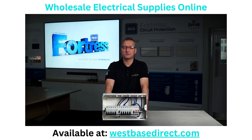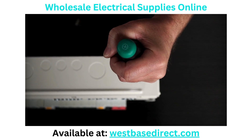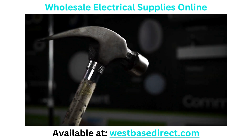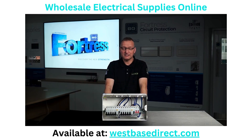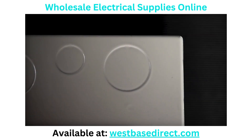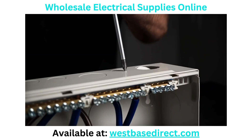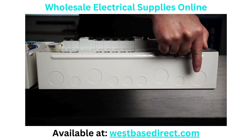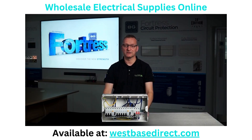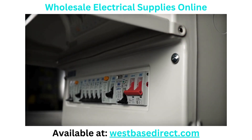Now while we're on the fortress theme, it'd be a good time to reflect on our historic knockout design. If there's one place you don't want it to be like a fortress, it's the knockouts. We've recognised the frustration tough knockouts can cause when preparing a unit for installation. Having to use excessive force to remove the knockouts is risky, potentially causing damage to the unit or harm to the installer. So to make the removal of the knockouts easier, we've removed some of the contact points, making them easy to remove when you do want them, yet secure enough to stay in place when you don't. We've also changed the position of the cable knockouts by realigning them to the right-hand side of the main incoming switch position, on both top and bottom of the consumer unit, improving the installation and termination of the incoming meter tails, and reducing strain on cables, terminals and devices on the DIN rail.